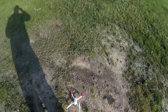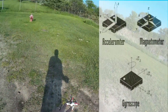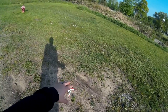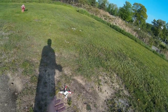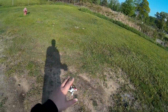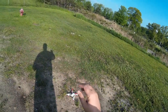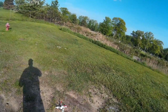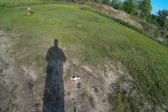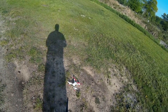There are accelerometers and gyros inside these things, and these could never fly without that because they're what keeps it level. What happens if a motor is underperforming — it has to try to adjust that motor as well as the other motors to keep the copter in flight level, because the computer's goal is to keep it relatively level unless it's being commanded to go forward, tilt, or yaw. If you have a motor going bad, this is something you'll see. Notice when I activate it, the other ones don't spin up equally, and then when I hit the throttle, you can see it.